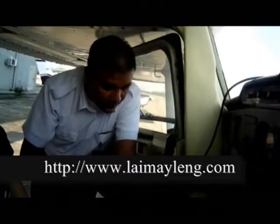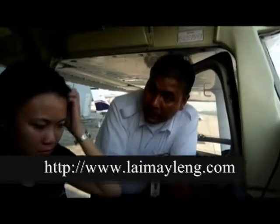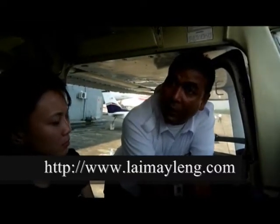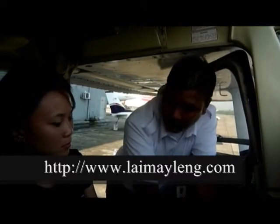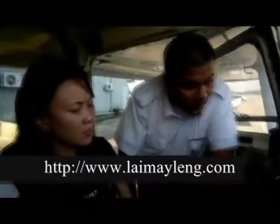Alright? Now during the initial startup, because this is the first flight, it will be a bit cold. So what we'll do is that we will use the primer. This primer is like a choke, like the olden days car, you know. You pull the choke and then try and start. Alright? Same thing. We'll maybe pull the choke 2 times so that when we start, we have an easy start. Okay? Now here are all your exterior navigation lights.